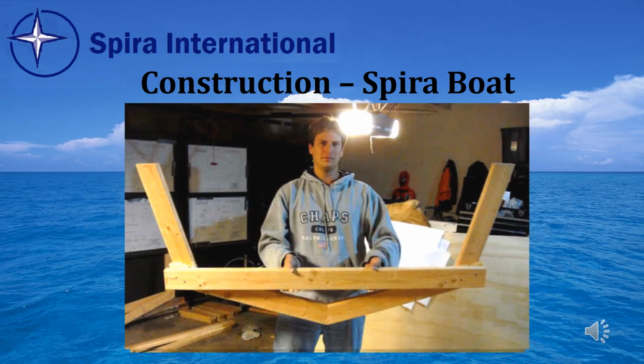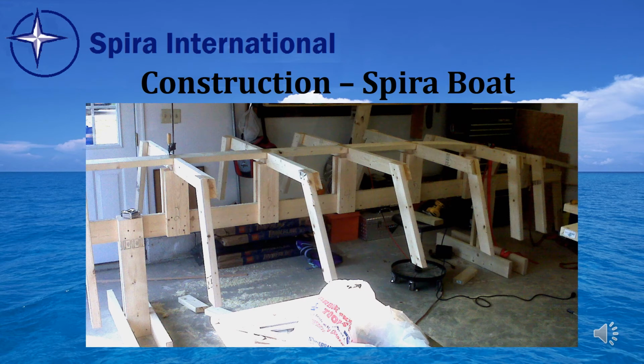When a V-bottom is needed, you can see that the framing is very similar, except it has a V-bottom made of straight elements of lumber. These frames are then arranged on a beam, which I call a strongback jig, and then a section of lumber called the keelson is used to tie them all together.